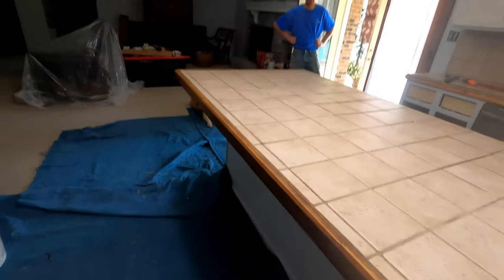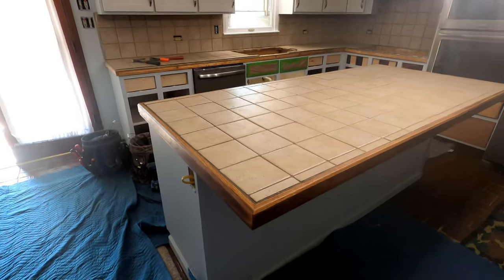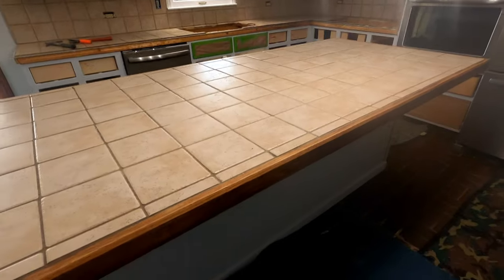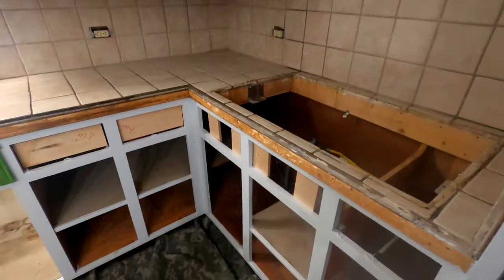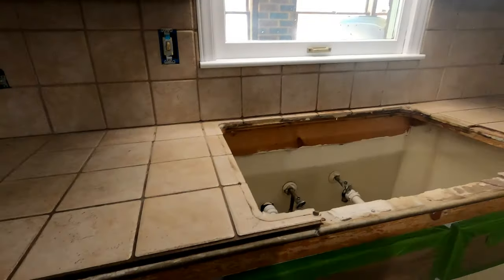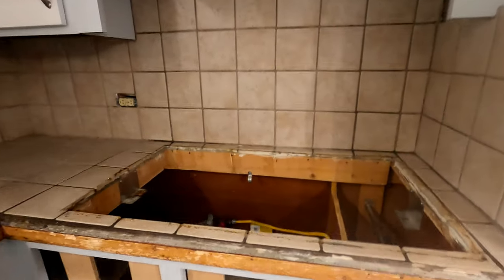It's going to be a little bit of a job to get it done. I've had a problem with my sales and office people explaining the process of full height backsplash when they sell a job, because it's a two-step process. Normally we do the install and then a week later we install the full height. The reason being is you can't get a perfect size on that full height without having this off and our tops on. Level plays into it, and the thickness of the stone and the wood underneath plays into it.